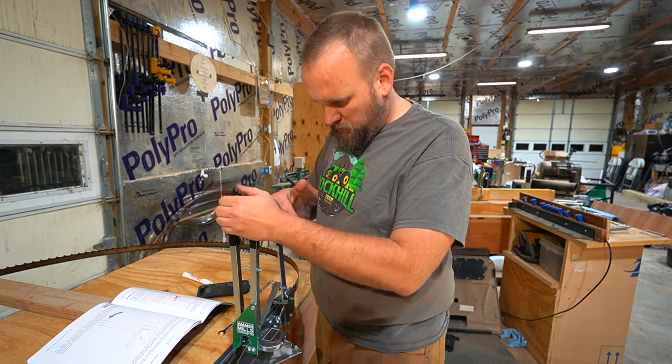But when you think about a blade costs $25, but say you can sharpen it 5 times, it only takes you 11 minutes to sharpen it. That time almost doesn't cost you anything. So by sharpening them 5 times, you reduce your blade cost from $25 a blade down to $5 per blade usage. Pretty dramatic difference. 50 blades pays for the unit.